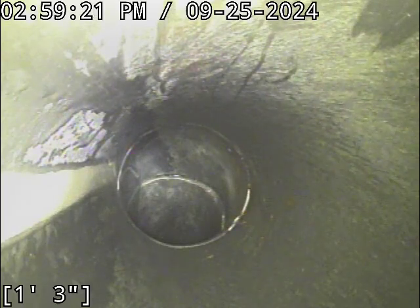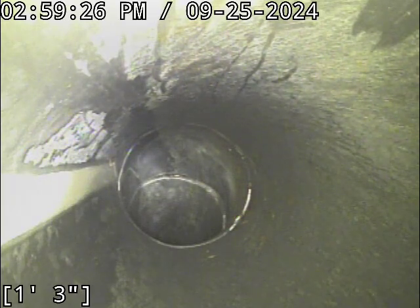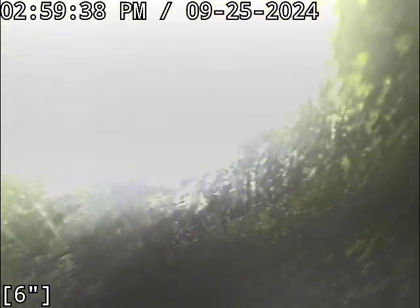The belly is too far from the home — at its worst point, it runs from around 45 feet to about 55 feet. If it were the first 8 to 10 feet right out of the gate next to the house, I would recommend you fix it. At the distance it is from the home, it just comes down to how you treat the sewer line. It would take flushing big wads of paper towels or things that don't disintegrate properly to ever block the line and back it all the way up to the house — that head pressure would knock things loose before it ever gets there.